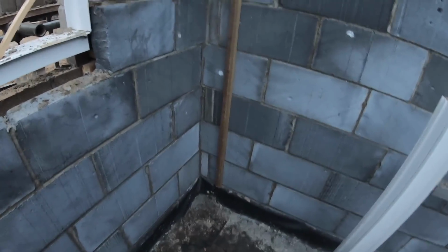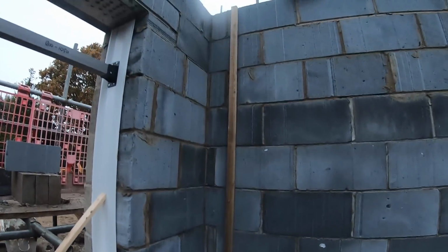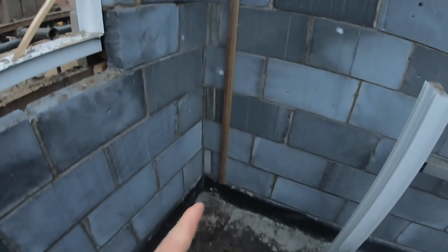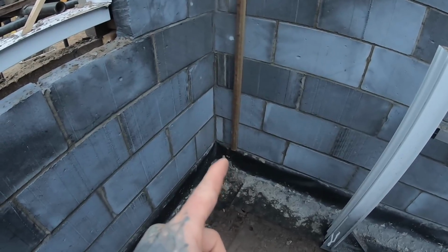height here, 2.7 from block and beam to underside of joist. So it's exactly the same as the other one. So we've got 3 courses of blockwork going on top of what we've already built. So that tells me how much we need to load out. So here's what I've done with this plot we've just finished. Made a batten up. I took 225 off of the batten to put it in from damp, but it still adds up to 2.7 from block and beam to the top.